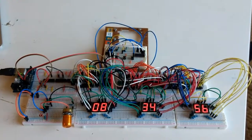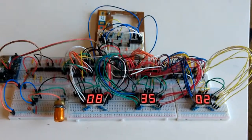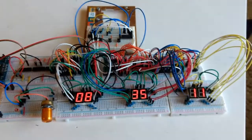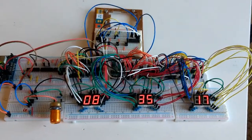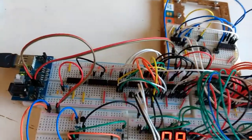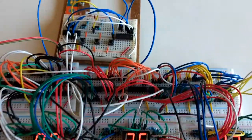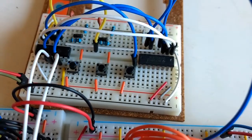This is a 24-hour digital quartz clock. It displays the time in 24-hour notation and has a control panel for setting the time manually. It is built using 7400 logic ICs — there are no microcontrollers here. It is driven by a quartz crystal. The time is set manually using three buttons to change the hour and minute sections.